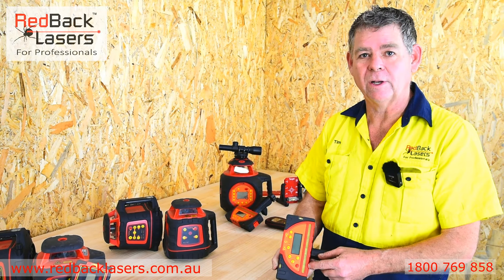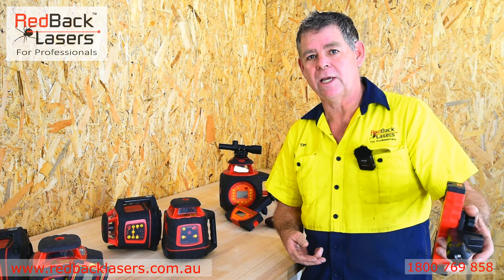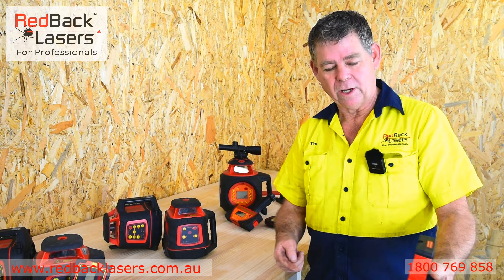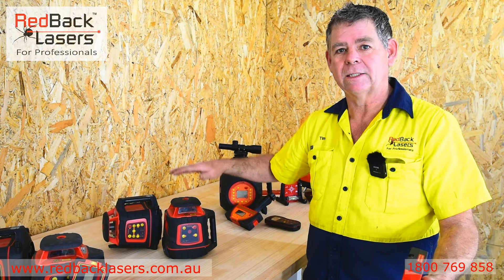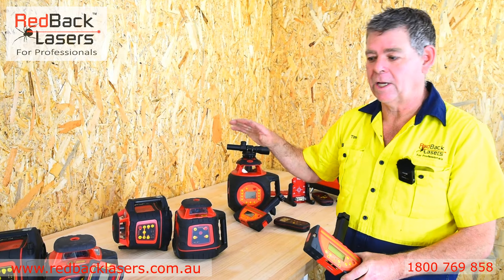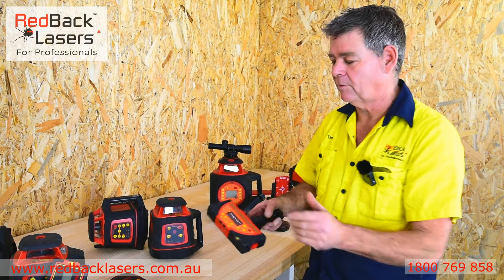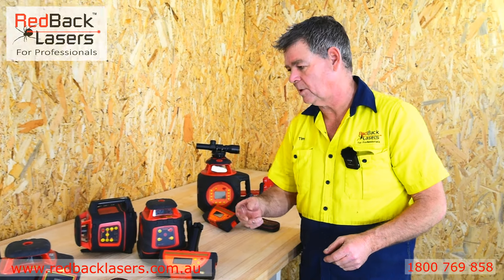That means we can read up to 45mm above or below our level indicator. Now if we get our receiver at our required grade, we can press a button on the receiver and the laser is going to match to that receiver. There are more videos on that below. It's certainly a lot easier to set a grade — we can still do a manual grade match with the remote, but you'll find yourself using that receiver all the time.